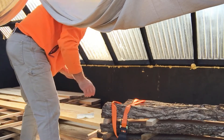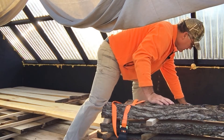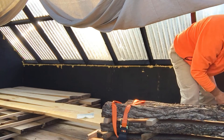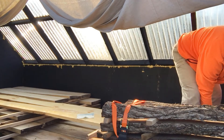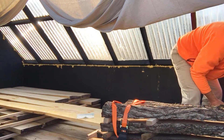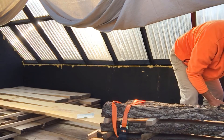This big six-by-six cant — you may be able to hear the alarm — that's 22.7, 21 percent. It's not very dry yet; of course it takes longer to pull the moisture out of thicker pieces like this.